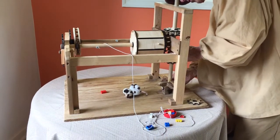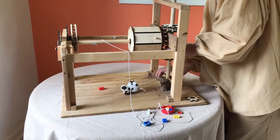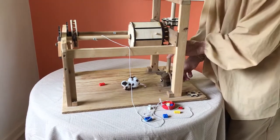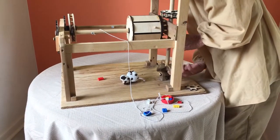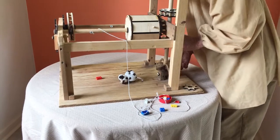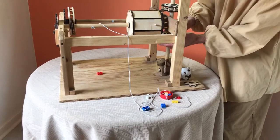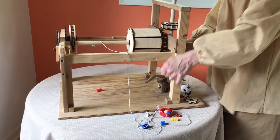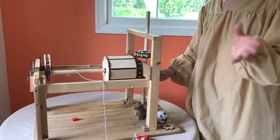What you do is turn this wheel down here. We'll turn this wheel and as we do that, I'm raising this thing, and now the top part of the gear is coming out of mesh, out of alignment — a little more until it's loose, until it's free. And now as the oxen keep going the same way, round and round clockwise, the bottom gears are in mesh and look at that — the drum is now turning the other way. So instead of lifting something, it's lowering it back down to the floor. This was completely unprecedented — the idea of having three different speeds and a forward and reverse gear. Nobody had ever heard of anything like it.